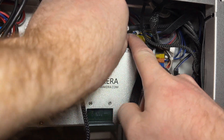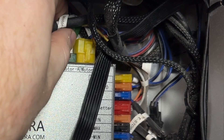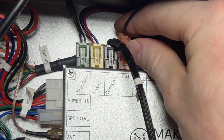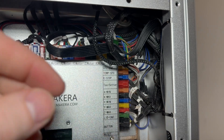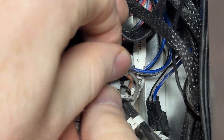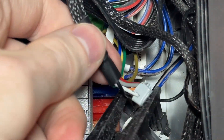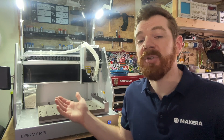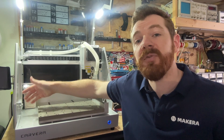With wires secured, connect the new wiring adapter to the controller board. First, disconnect the existing green 4th axis connector from the motor A port on the top row of terminals, then connect the new green 4th axis terminal from the wiring adapter harness in its place. Next, connect the orange connector from the wiring adapter harness to the open terminal on the controller board labeled EXT. Then, using the T-type quick connector included in the adapter kit, connect the single cable of the wiring adapter harness to the white cable of the existing tool setter port. Ensure a tight connection by closing and locking the T-type connector with pliers. We will no longer use the original connection ports on the side of the bed for the 4th axis and manual probe — instead use the new ones from the wiring adapter.